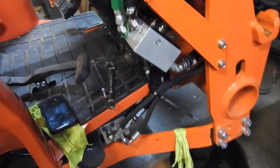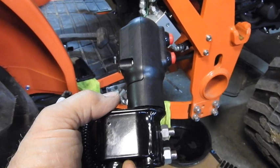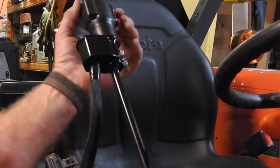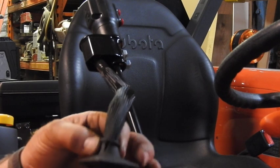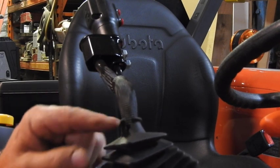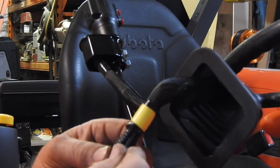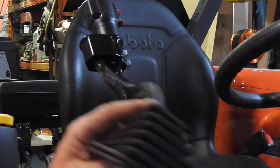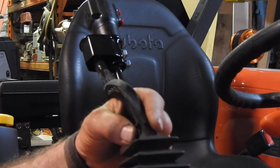At this point all the hydraulic connections are completely done and everything is tightened. The electric kit consists of a wiring harness and a replaceable knob that goes on the end of your control arm up top on your control valve, attached by two set screws with lock nuts. Pull the old handle off and slip this one on and tighten her down. With the push button control installed — buttons to the left of the tractor — the instructions actually show cutting a notch out of the boot. What I did was just cut a little slice down on two sides in an area large enough to allow the fuse — they have a 5 amp fuse built into the wiring harness — to pass, as well as for the three Molex plugs one at a time.